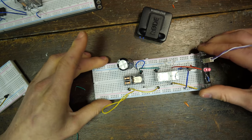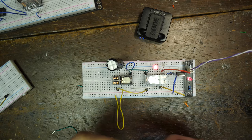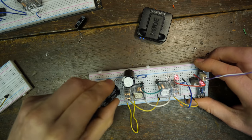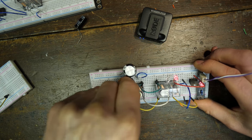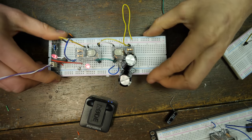And that's when we add 2 relays to the circuit. You get a much more symmetrical clock. And if we double the capacitance here, we'll actually get it twice as slow. So we'll double the capacitance. And now we made it twice as slow and it sounds like your car. Let's go back to the first circuit.